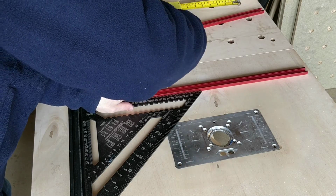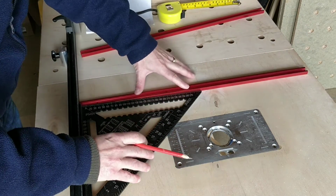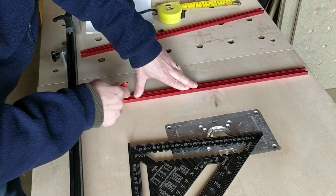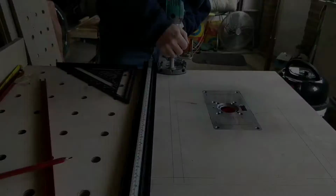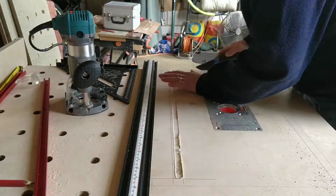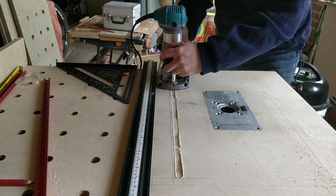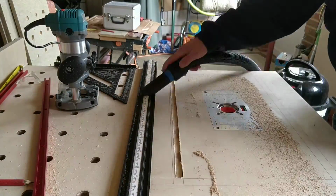I want to fit a couple of T-tracks to the top which will enable me to secure a fence and accessories such as feather boards. I'll cover the fence build in more detail in my next video. I now take several passes with the router. I'm cutting across the grain on the top of the ply, and this makes it look quite messy. I was worried at first, but it cleaned up really easily with a chisel.